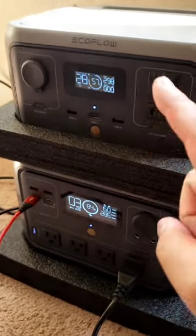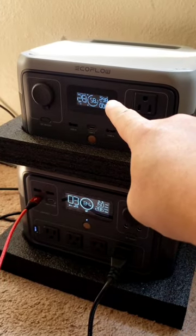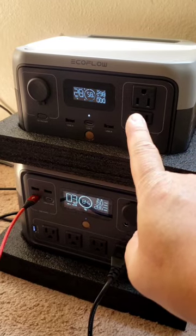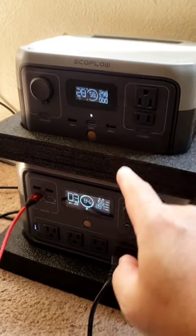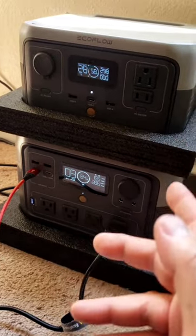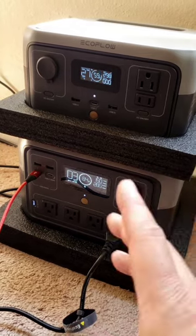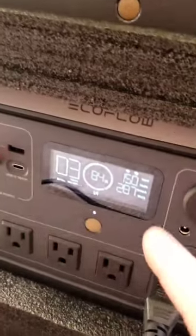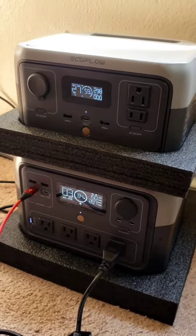I did some changes — both machines are now linked to the app. I limited this unit to about 300 watts fast charging through AC input, solar unrestricted at 110. I also limited the other to 800 or 900 watts. Fast charging is good but sometimes hard on the battery, so I want to go about 80–90% speed, not full 100%. It's now running on 300-watt charging and still doing pretty well at 150 watts.